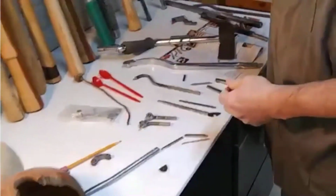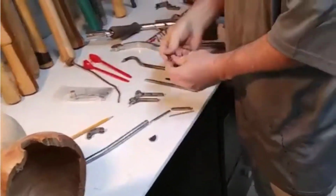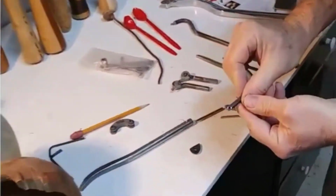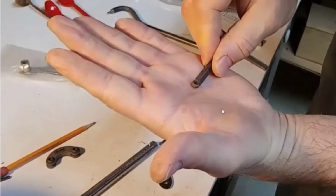If I had to add one more tool, again, I have plenty of tools here, but if I had to add one more, I would get a smaller diameter shaft. Okay, before I go on, this is a carbide cutter. This is a Hunter carbide. Those other ones I showed you were just plain garden variety flat carbide cutters that are straight, and they're definitely scrapers. But the Hunter has a cup shape, and it's much more like a cutting bit rather than a scraping bit.